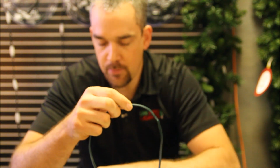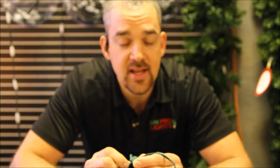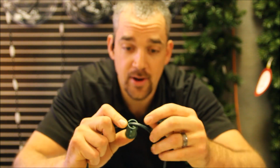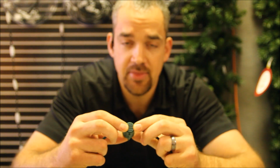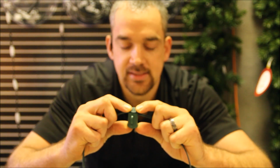So I'll take my replacement socket and make sure that it's facing the right way. It doesn't matter as far as the rib side or the smooth side, just that it's in the right direction that you want it to go. Then I'll take my little backer, and this backer will just slide over the top, and then I'll clamp that down with my channel locks. That works the same way as a slide-on plug does.